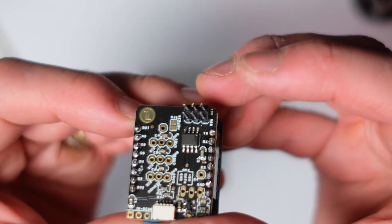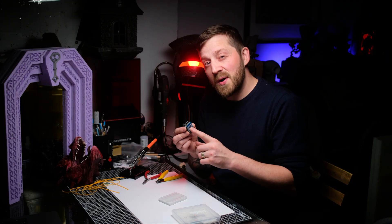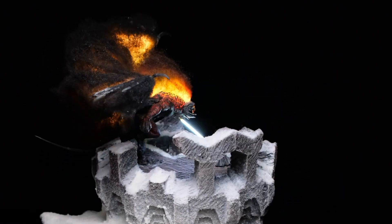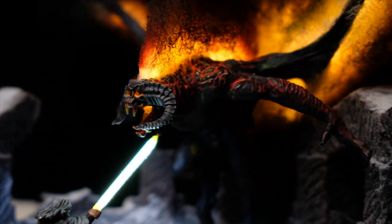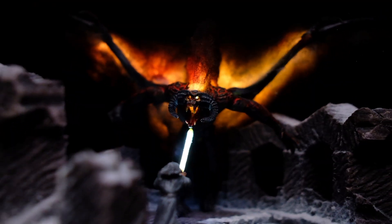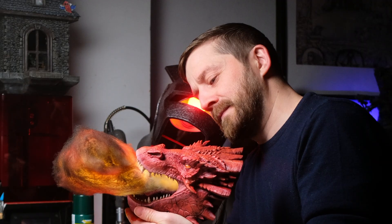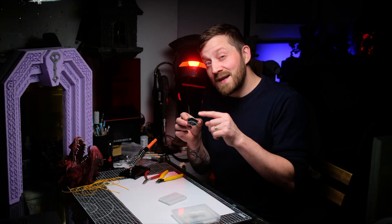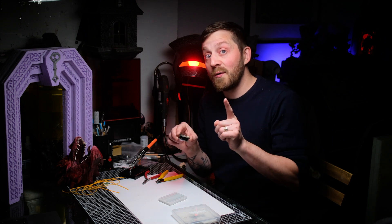I have my six pins that are going to connect to my three noodle LED lights. Speaking about the brain and the project, the code that we are using is the exact same flicker pattern that we used in the Balrog project that I did a few months ago. If you're interested in using this code for your own project there is a video by TerrainTronics in the description explaining exactly how to load the code onto your WeMOS D1 Mini using the TerrainTronics code loading software. There's also a link to the new updated code specifically for this Smaug project. The only difference is that Daphid has slightly changed the code so that we can include the use of a reed switch, which we're going to wire up next.